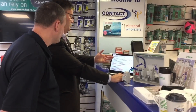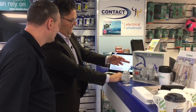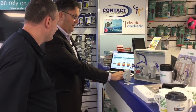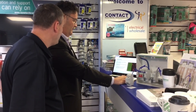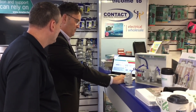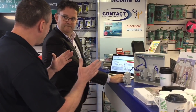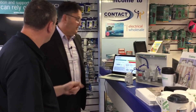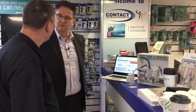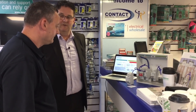The types of arc faults include parallel arcing faults, serial arcing faults, and lots of loose connections and conductors where RCBOs and MCBs typically won't pick them up. This type of technical data and presentation looks absolutely fantastic. Is it something we can pick up off your website? Not at the moment — it's about a 40 meg download — but it's something we can present to you. We are working on a card for electricians as a guide. Arc fault detection is still a bit of a dark art until the regs are launched, and the vast majority of electricians are pretty much in the dark about it at the moment.